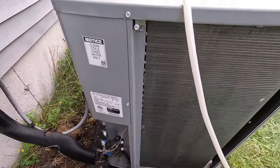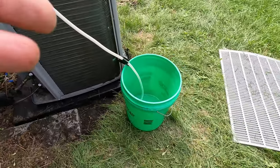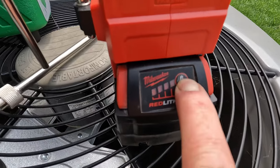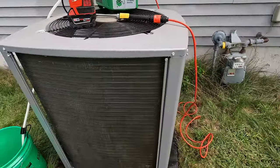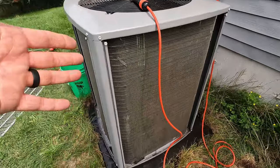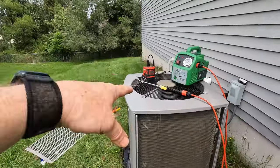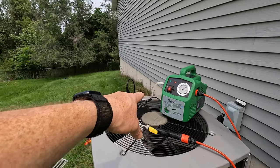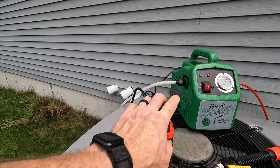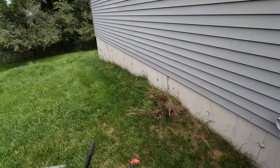That saved me half a string of hose, and if they didn't have anywhere to get water outside, I could always go into the bathtub or sink and fill that up. I still have full bars. I used it on that mini split video — I'll leave the link in the description. I don't recommend it for that, but for outdoor coils and even evaporator coils inside, this Porta Blaster is the way to go. I'll leave links in the description for the Porta Blaster and the Milwaukee Top Off. You'll probably already have a battery, but you'll need this Top Off — no extension cords, nothing. This will save you so much time.